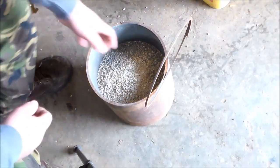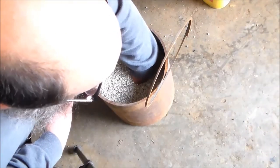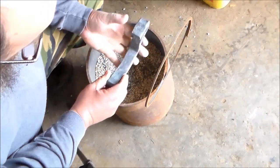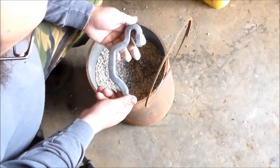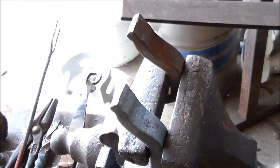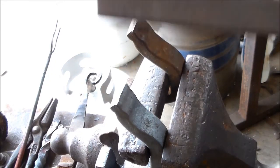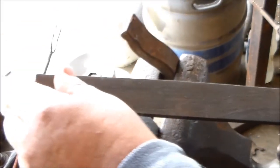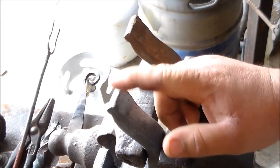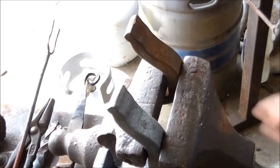It's been about 14 hours since we put this in, and it's cooled all the way down. Here's a clip that is not annealed, and here's the annealed clip. You can really feel the file digging in on the annealed clip — it's just kind of skating across the one that hasn't been annealed.